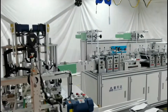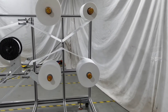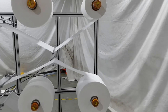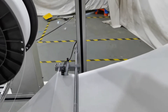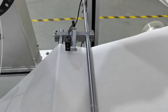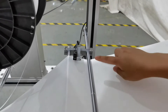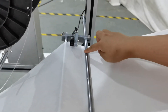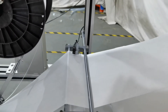Now I'm going to introduce our machine in detail. Let's start with the material rack. As we can see, there are four layers of fabric. Each layer is equipped with sensors — if it detects there's no fabric on a certain layer, the machine will stop automatically, which can reduce the rate of defective masks. The brand of sensors we use is Panasonic. It can detect fabric in black color, so you can produce black color masks if you want. This is one of our selling points.